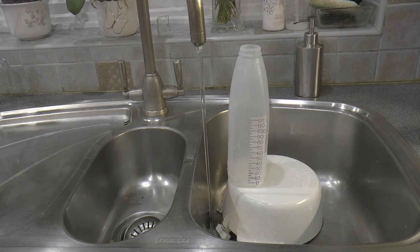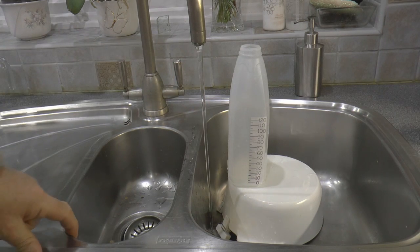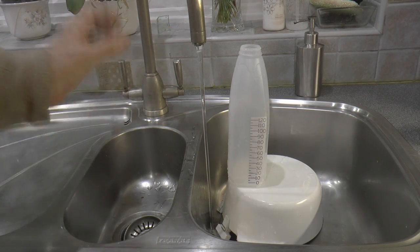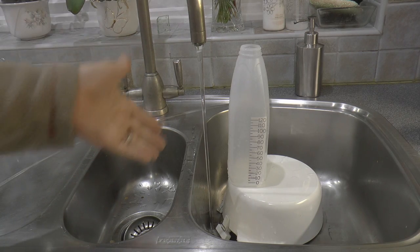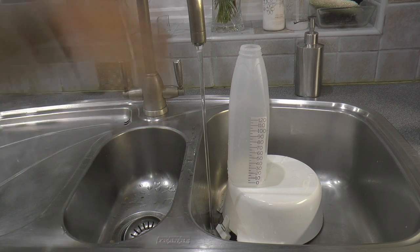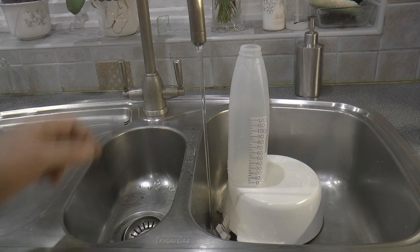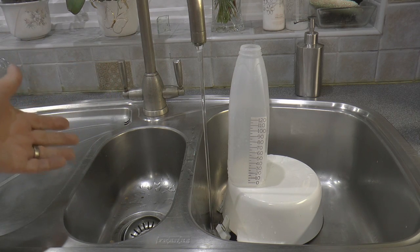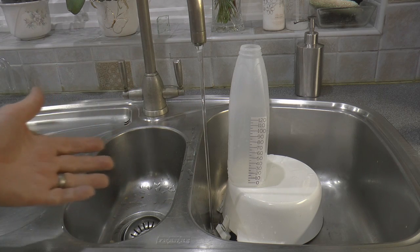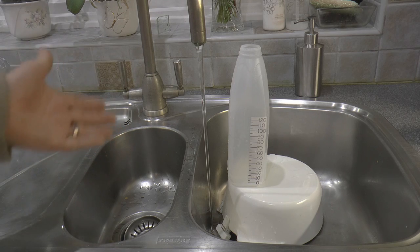Welcome to my science laboratory. Now, you might think this is a stream of water, but in fact it's a steady stream of infrared energy. It's probably equivalent to about, say, 20 watts, but it's flowing out of my laser tube, and what I'm going to do, I'm going to collect it in a calorimeter, which is the standard way of measuring power from things.